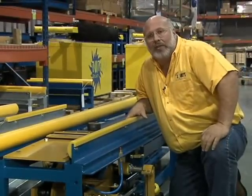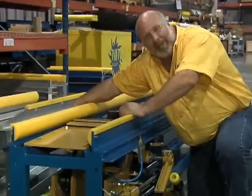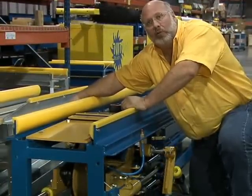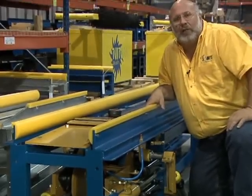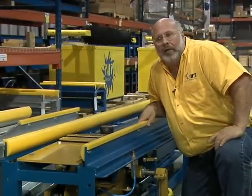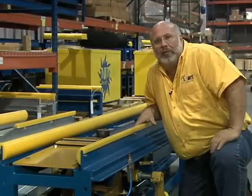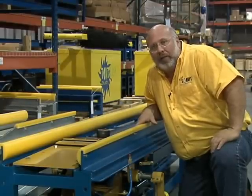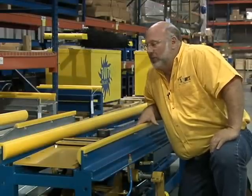Service on this machine is very easy, especially with the air take-up — you can relax it, the roller-up doesn't jam, allowing you to be more efficient, wash more cars on busy days with less downtime. There's a foot pedal on this side — just move your foot forward a little and it activates a roller, so you can catch one in case you miss one. We couldn't have asked for faster or wider acceptance. This is now the standard conveyor we send out every day — 90 percent of our sales — accepted in both front-wheel pull and rear-wheel push applications.